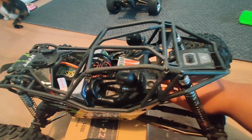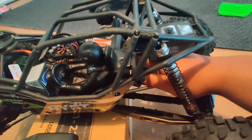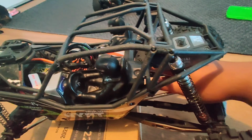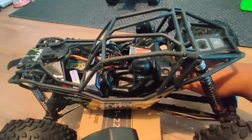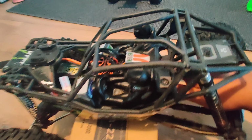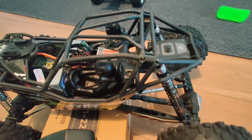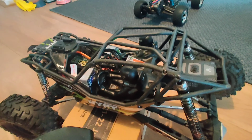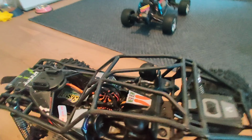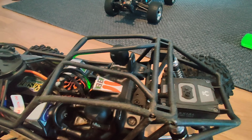It's not complex, but it's written in such a complex way. There's a set button and a power button, and what we do is first power on the ESC using the power button. Once the ESC is on, you need to press the set button until you see this green light flashing and leave it. This means the ESC is on for programming, and you can go through the programming manual and set things like the drag brake, the maximum brake force, the maximum forward force, and the initial start mode.